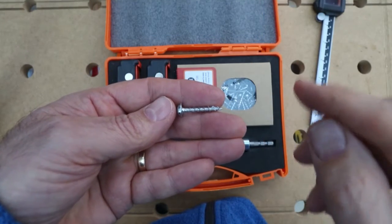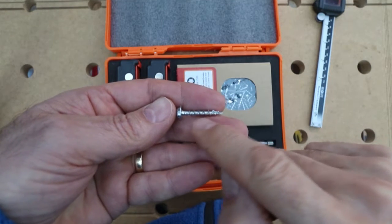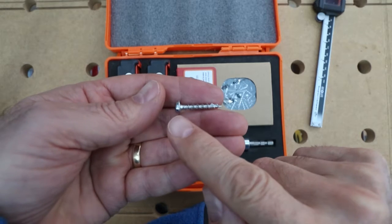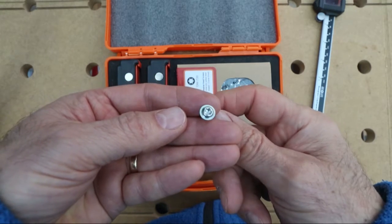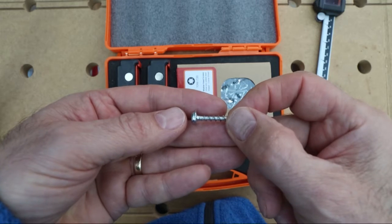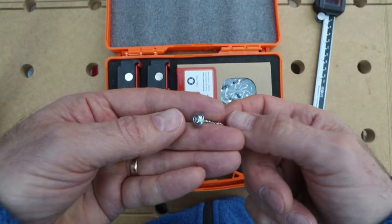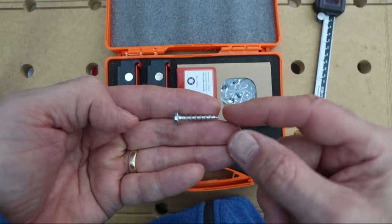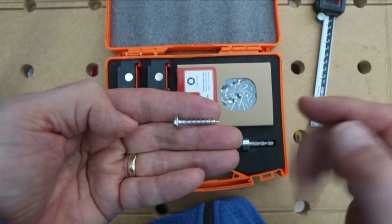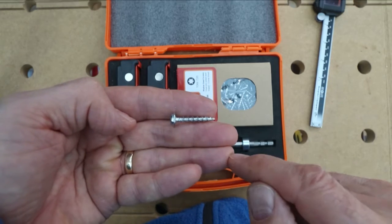This is one of the screws that come with the kit in that box there. It's a standard wood screw at this end. There's a swaged head, and that head also contains a washer. It's not actually a separate washer, it's one that's swaged along with the head. The socket in the top of the head is a T20 Torx, and that is the screw. There are plenty of other lengths, going right up to 50mm or so in length. They're all purchased separately.